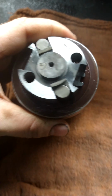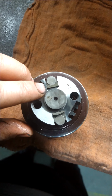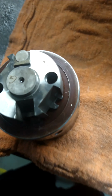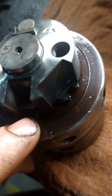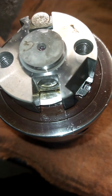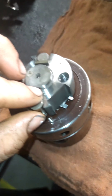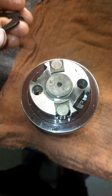Everything's pretty finicky. Anyway, so you can see here, these are what I was telling you, called your cam followers, and you can see how they've got to be opposite of each other. Here, let's do this one here. So you can see there's a little ring at the bottom here, that guy, and then inside, see if we get it to focus, you can see there's a little groove basically that this will ride in, right? So you stuff this thing down in here, make sure it's flush with the top, and then make sure it's opposite of the other cam follower, and then